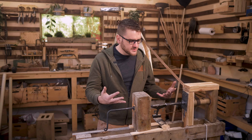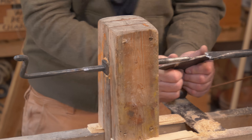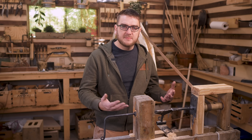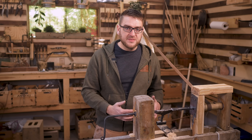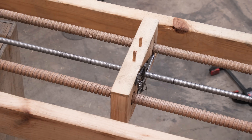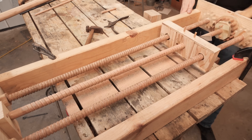This last version really shows the power of the screw. DaVinci's screw-making machine is just a huge game-changer for what is possible. Because up until really well-developed lathes, screws were still being hand-carved, which means all the threads would be inconsistent and non-interchangeable. Now with his machine, we can make a repeatable thread of consistent size. The use of two lead screws makes it a lot more accurate — when the machine runs it's very wobbly, but it's surprisingly accurate despite that, because the two lead screws mean the whole thing wobbles together consistently.